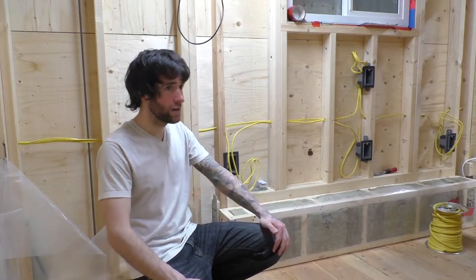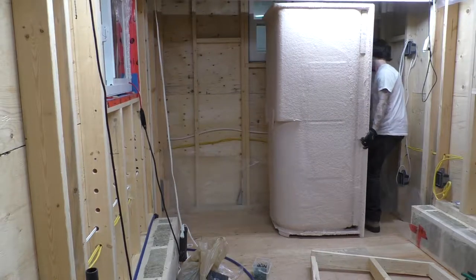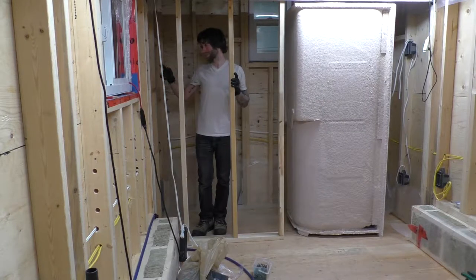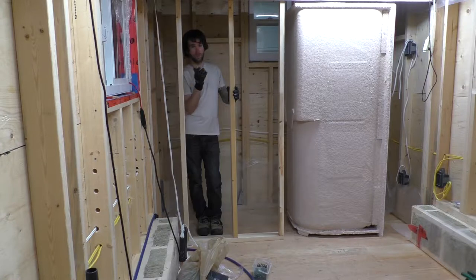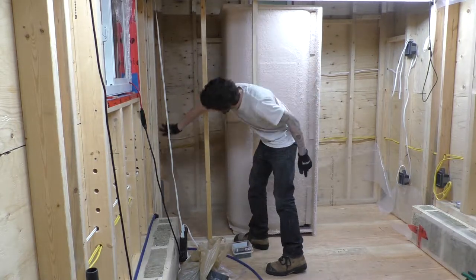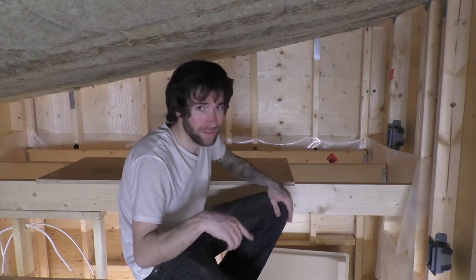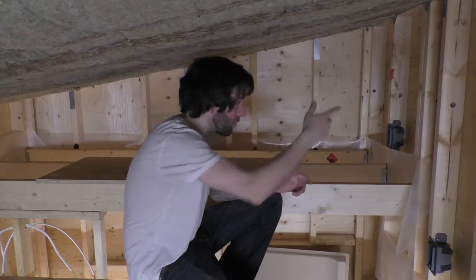Jackie had to leave, so I'm going to try to do a lot more on my own, but there's not a whole lot of point to filming it because it's just going to be me pulling cable with a lot of repetitive action. I got the bathroom line done for the bathroom outlets, and then I realized the next lines need this wall in here. I need to put some vapor barrier on this stud and Acoustaseal behind before I do that. This wall is now a 2x4 thick, so it'll be a better fit with the shower on the inside of it. I find it easier to just cut what I need for that little bit of a run rather than dropping loops, making little segments as I go. Loft is done - much easier.